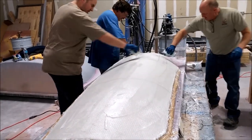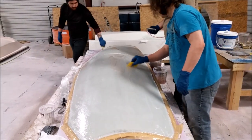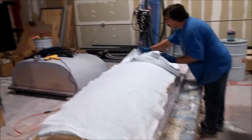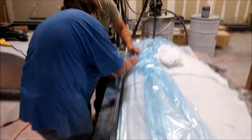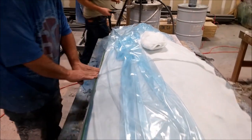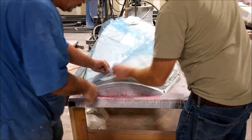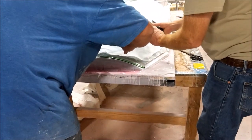There's a tape seal around the edge to make cleanup easier — once the resin is down you pull the tape off for a clean edge on the plug. Then you lay down double-sided sticky putty that adheres to the plug, put a plastic bag over it, and seal it around the edge for vacuum. Jeff is laying out a cotton fabric that allows air to be drawn out uniformly from all areas, preventing air bubbles. Then the thin plastic film is sealed against the double-sided tape, a small hole is cut in the center, and a fixture is attached to the vacuum pump.